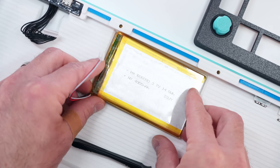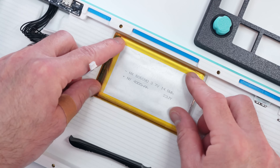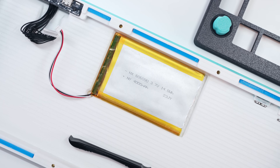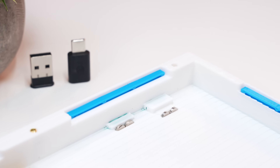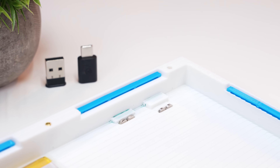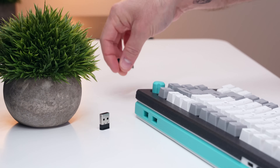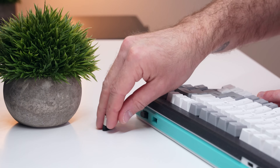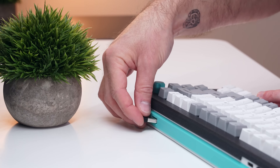In the future, I'd like to look into getting a larger battery so that I can extend the keyboard life while also avoiding the need to remove this from the original case. Then, on the back right, we can see that there are a few protrusions, as well as two slots for pairs of circular 6mm magnets. These help to secure the two USB-A and USB-C radio frequency dongles that come with the V1 Max, which slide into the back right side of the keyboard.